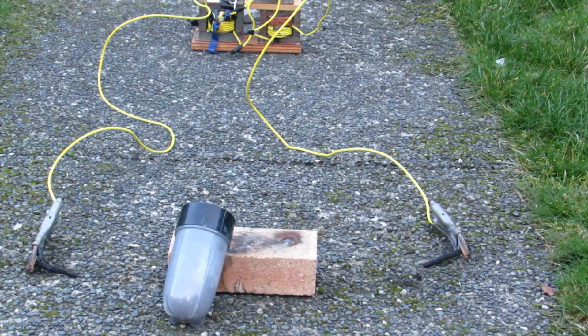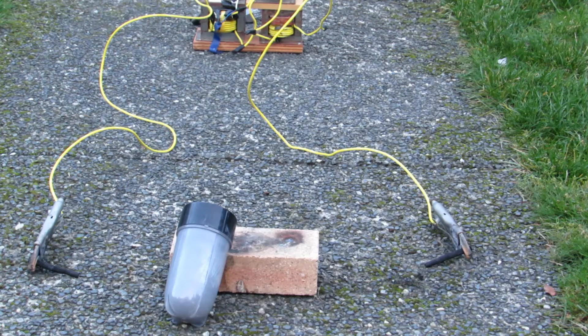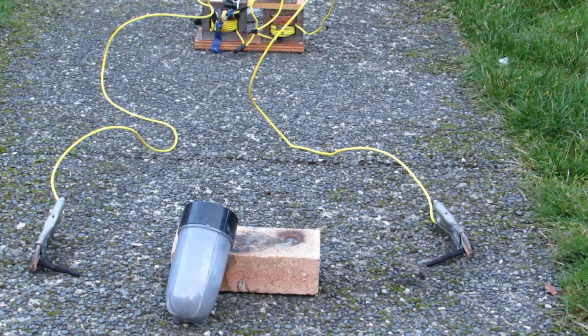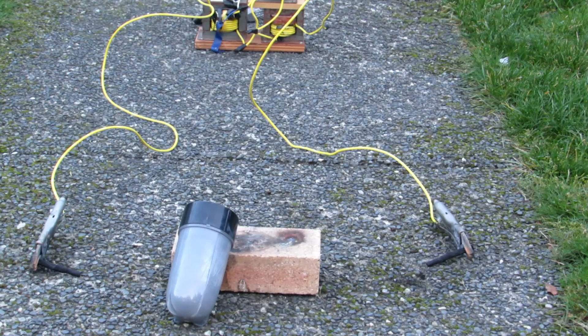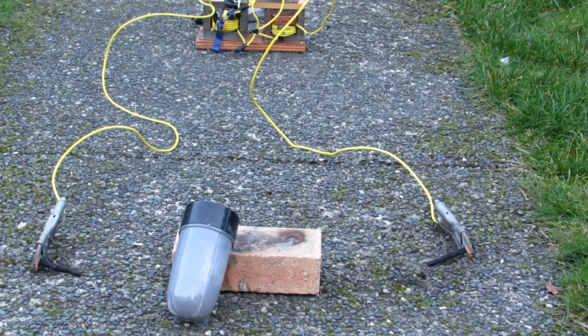In the blender I have our leftover reactor mixture — it smells terrible, but I ground it up into a really fine powder, which I think will help it melt. Titanium melts at just over 1600 degrees Celsius, so you can't use a blowtorch — it must be something like an electrical arc furnace, which is very, very hot. I'll pour it out and arc furnace it until hopefully most of it's molten. The slag, which is primarily aluminum oxide, should hopefully protect the titanium from oxidation so we get a nice, shiny bead at the bottom.